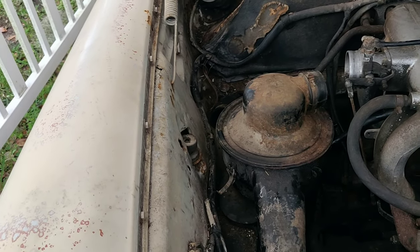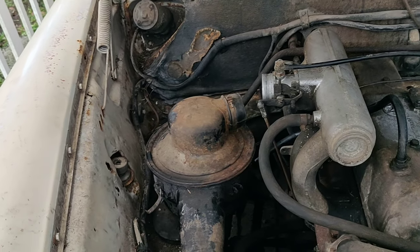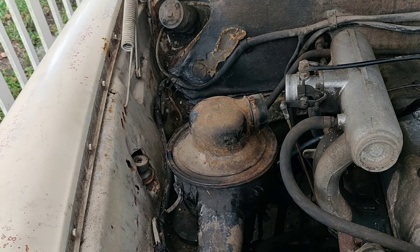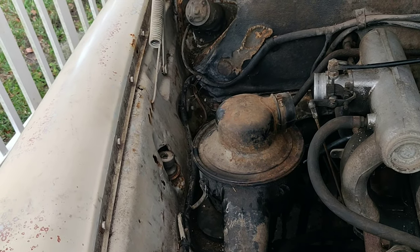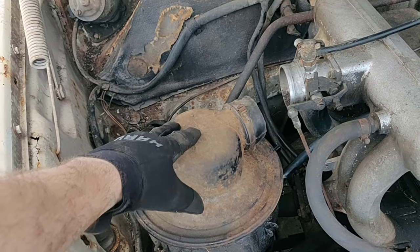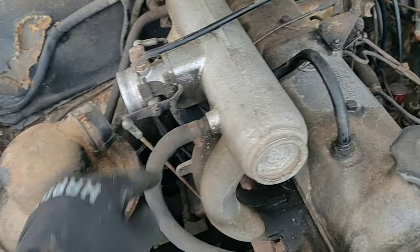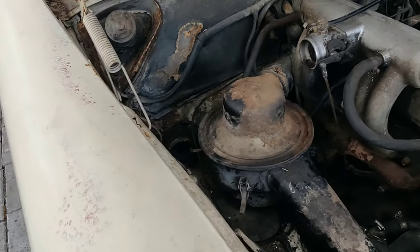I was trying to research new air filters because we're going to be doing a whole tune-up — changing out our fuel filters, of which there are a few, and changing out our oil filter and oil. I wanted to change out the air filter and get this thing idling and running a lot smoother. Diesels will smoke like crazy, and I thought what we were seeing during startup was more normal. But you can see here there is a hose that runs right from your valve cover, around and into this air box — which was not installed in the car; it was in the trunk.